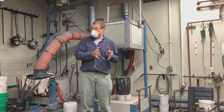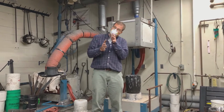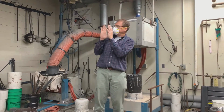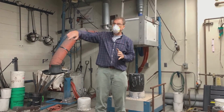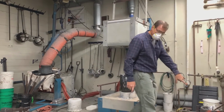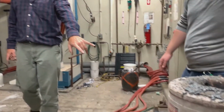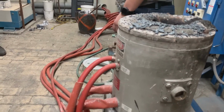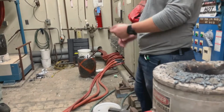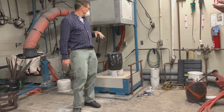So the deal is that up against the metal, it's metal temperature, right? But 1.5 inches or 2 inches away, it's water temperature. So you've got water cooling going in there. These hoses are not only cooling water, they're also the conductors. Inside the middle of that rubber hose is a big braided copper cord that feeds the furnace.